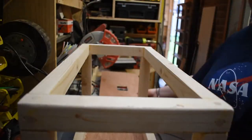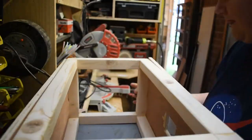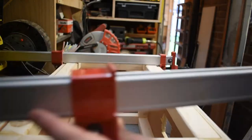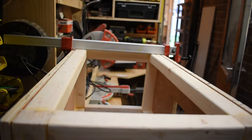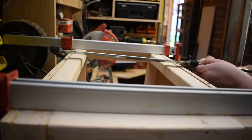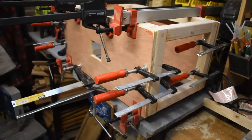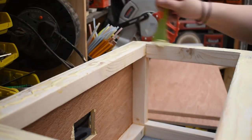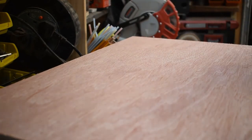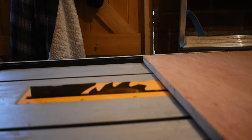I glued on the top and bottom and used clamps to hold them down — at this point I was still thinking I'd put 45-degree angles on them. I just held both on at the same time because I didn't have enough clamps, then later realized I could use smaller clamps and not clamp them straight across, so that's what I did to make sure everything was clamped down evenly. Once dried, I put the sides on and brad nailed them in, making sure to keep far away from the edges so I could put a chamfer on later.